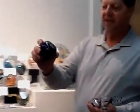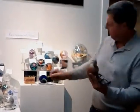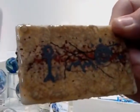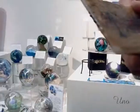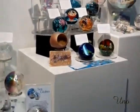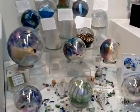The island in paradise, we make the island. You can't buy islands anywhere, so we have to make the island. This is the piece of glass that we make, and then we hand paint and draw it on there. That gets melted again and put inside. So it's hand painted? It's hand painted, handmade. This way everyone's going to be slightly different. We fire on the paint, and then we pick it up inside, heat it, and twist it to make it that way. So you see, there's no store that you can go to buy what you need. So when we make a design, we go start to finish, because we have to supply everything ourselves.